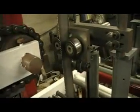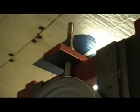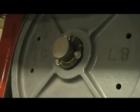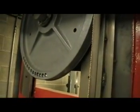Here's the same Pallet Master blade — this is the saw. The saw is a pretty basic design, about seven feet tall. It's a top guillotine design. The top wheel can slide back and forth, and the tension is placed on the blade by a jack screw up there — it's a one-inch jack screw. We can put enough tension on the blade pretty much to snap it if we wanted to, but obviously we don't. It's a 45-pound lifting plate that we converted into a pulley for this saw. We had to dress the outside edge.